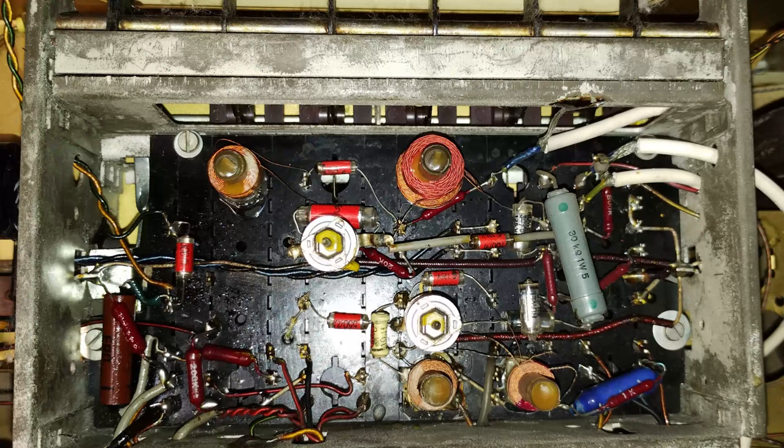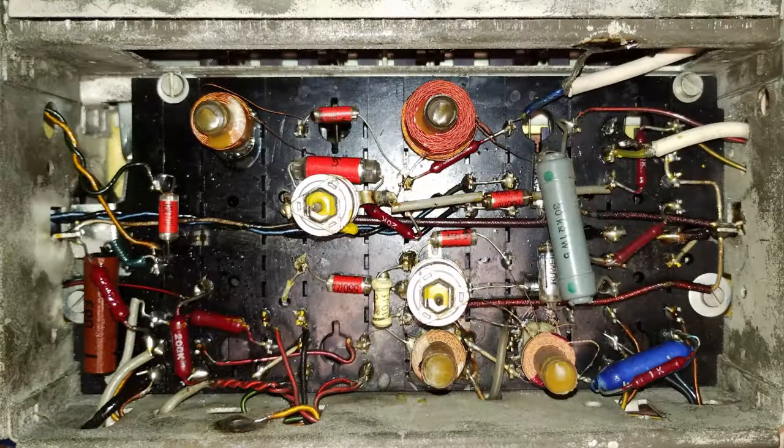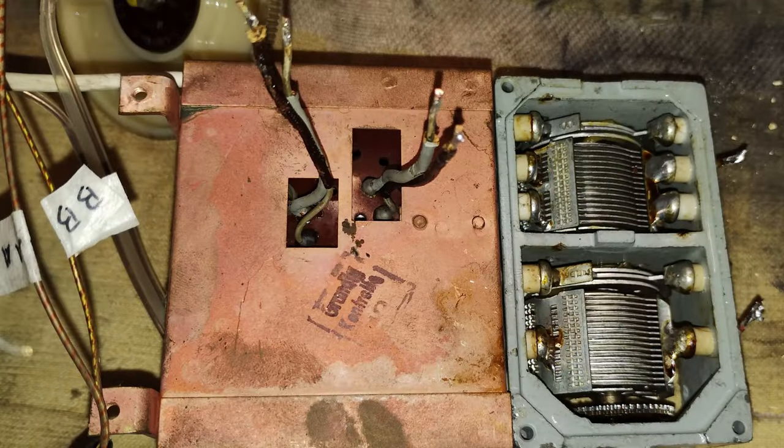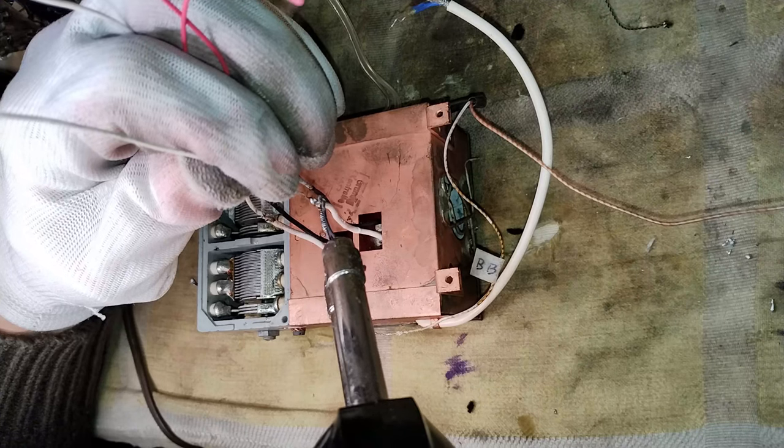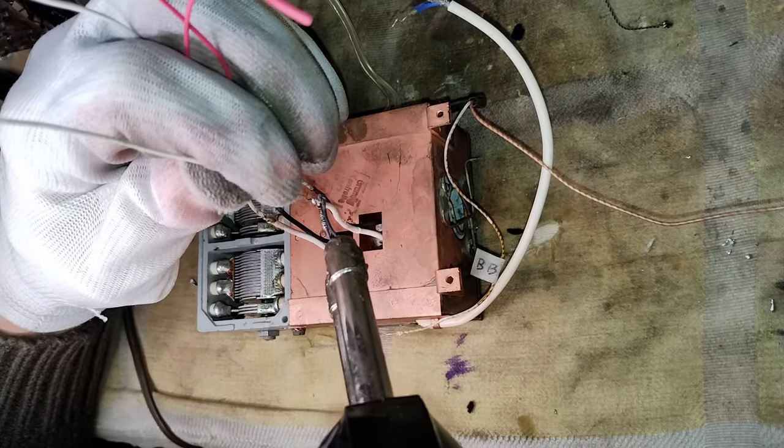The effort of trying a solution for the shorting variable capacitor obliged to remove and then to reinstall the FM tuner. Here are the connections that should be detached on the board located under the keyboard switch. There are a few more wires to take care of, connecting the B+, the ground and the antenna, but their destination is not the board under the keyboard switch, and therefore they are easily visible.